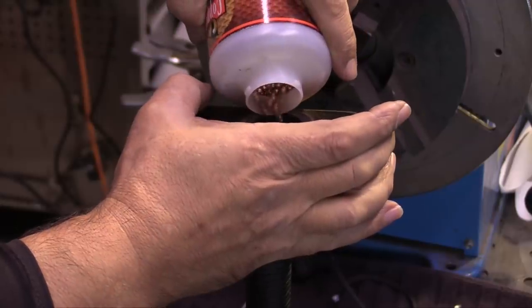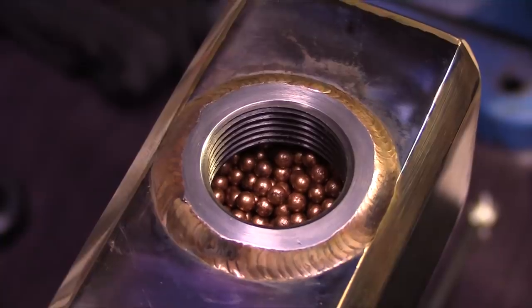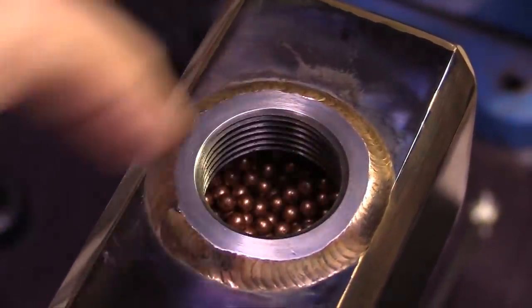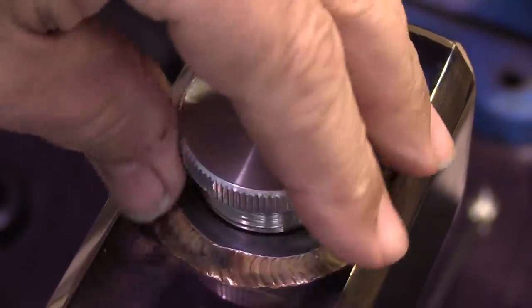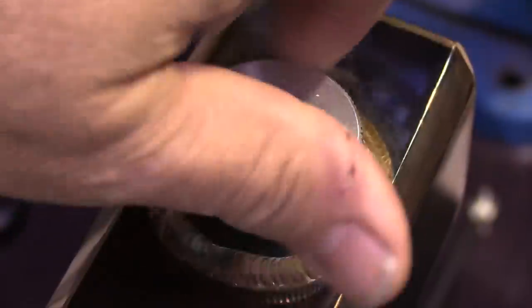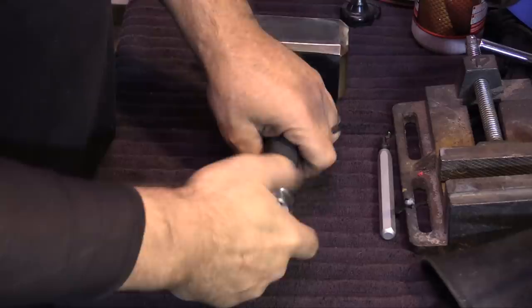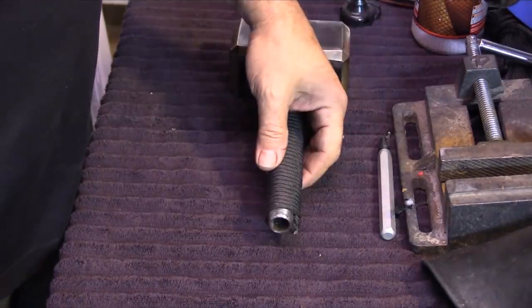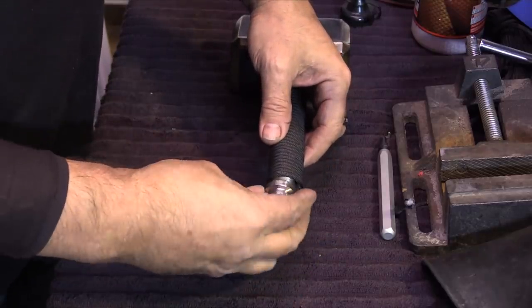I may come back and add a little sand or lead shot - don't know, going to have to try it out. I filled it up about a little bit more than three-quarters full so they have room to shift around. The hope is that it makes it into a dead blow where the hammer doesn't rebound much when you hit something with it. With a hollow handle and end cap like that, I've got a place to keep a center punch, so at least I'll be able to find one now - if I can remember to put it back every time.